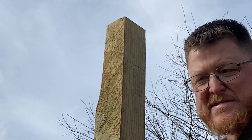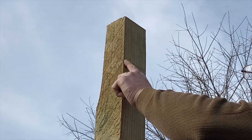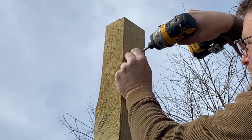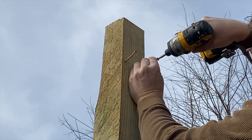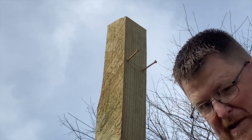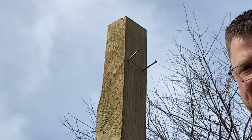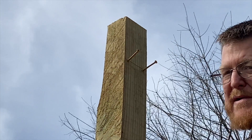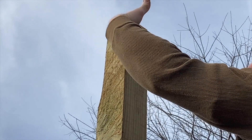One tip when doing this by yourself — when hanging larger pieces in a long run, put a ladder at both ends, mark off your level line, then take two nails or screws and put them just below that line on either side. The board can rest on these while you work. I've also already started my screws at every point along the board so when I get the board up, I just grab my gun and put the screws in. Using two supports instead of one prevents the board from tipping and keeps it in line.